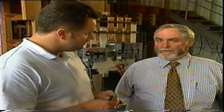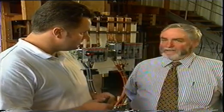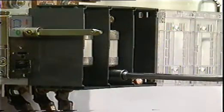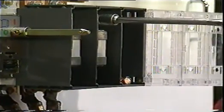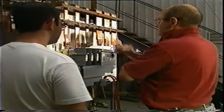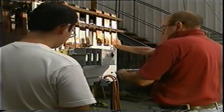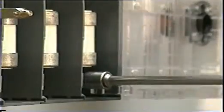The first test where we just closed the supply onto the fuses already faulted, and the fuses cleared the fault. Now that was fine, but the second test where we actually closed it onto the fault using the mechanism didn't damage the CPS unit. After fault interruption, fuse replacement downtime is inevitable. However, it is definable and predictable, being limited to the time taken to replace the fuses.